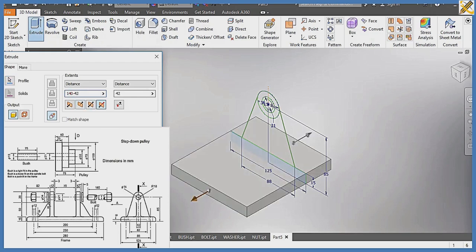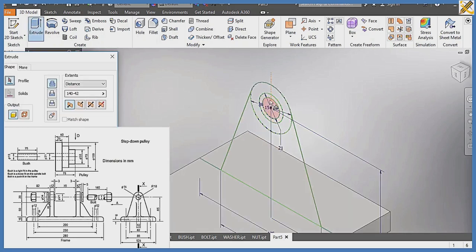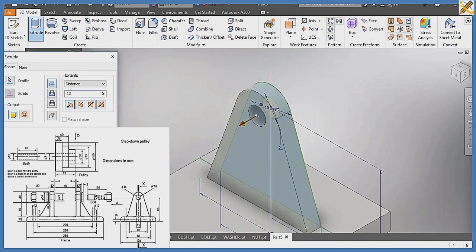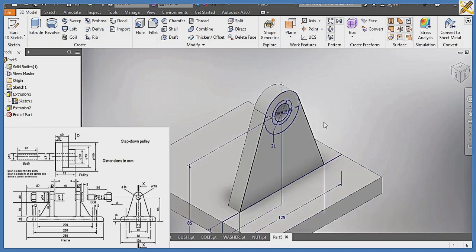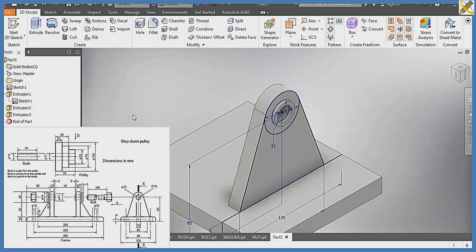Yeah, correct. Okay, I click on this thing, share sketch. Clicking on my extrude right now, I'm clicking on this and this. Out here is a length of 12 towards the outside here, and I click okay. Seeing this area here, I'm going to click on extrude, and I'm clicking on this right here, and that is a length of 3, facing this other side there.